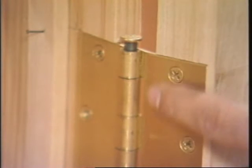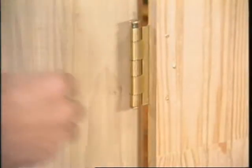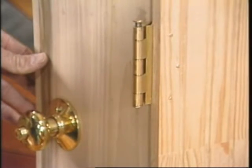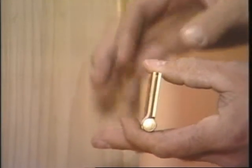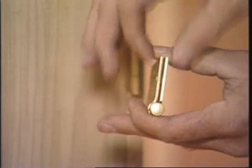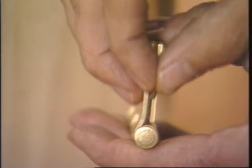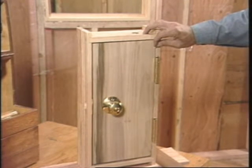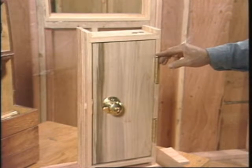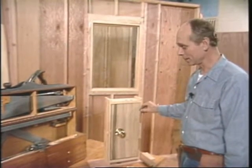You can see that the mortise for this hinge leaves the surface flush with the edge of the door, and I've left about 3/16ths of an inch here, and that lets the barrel of the hinge project out beyond the face of the jamb so the trim will fit. Hinges are bent — that's called swaging — so that when the leaves are closed, they'll be parallel. You need to check your hinges to check the swage because you might have to make the mortise a little deep or shallow to control the margin on the side. There's another way to change this margin called throwing the hinge — you can shim behind the hinge leaf, and that will move the door either way. I'll tell you more about throwing the hinge on the next doors I hang.